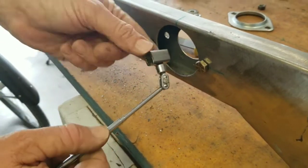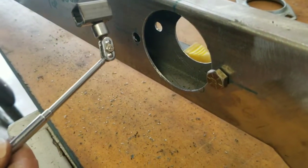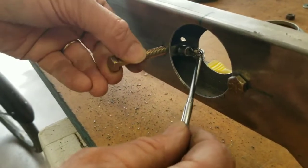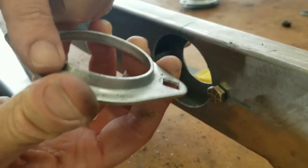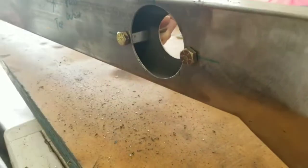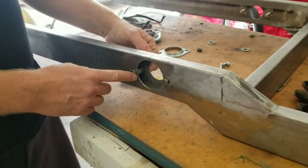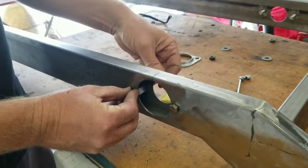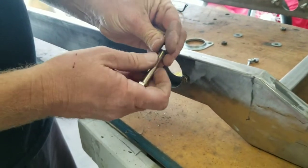Here is the square tubing cut to fit inside the frame. You want clearance to make sure there are no little burrs — take a file or a deburring tool like this and clean out everything around it. This slides right into the hole, then your bolt goes through it. We'll make sure it clears so it doesn't interfere with the bearing race once it goes in, because of the small space there — you want those out of the way of the frame. One other thing I've discovered after building cycle carts: use nylox on almost all these bolts so they don't rattle loose. But when you're doing your mock-up, use normal nuts so you're not having a hard time threading and unthreading things. Save the nylox for the final build.